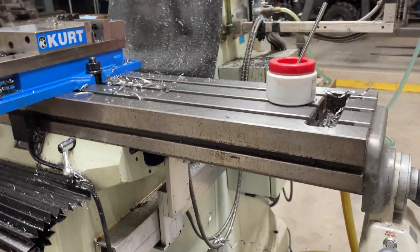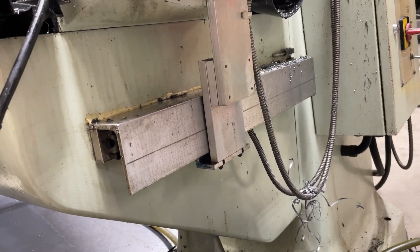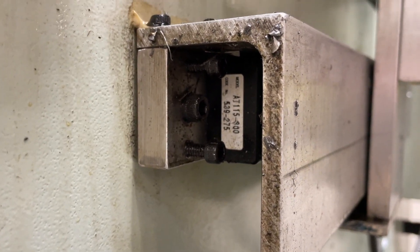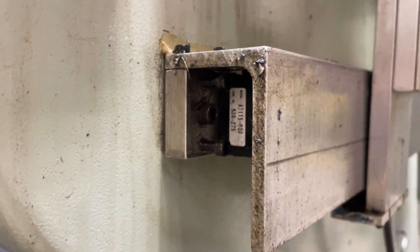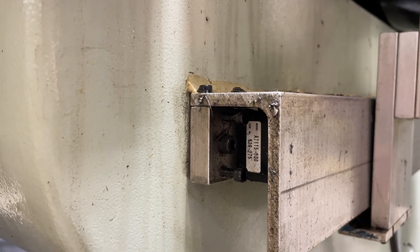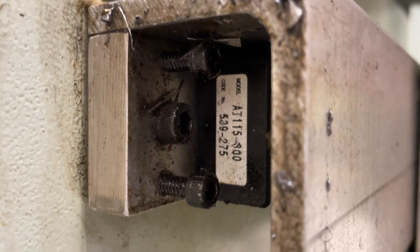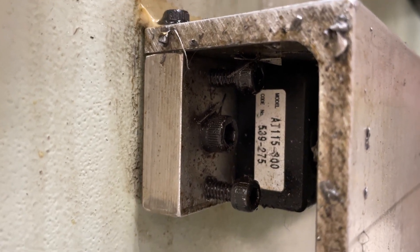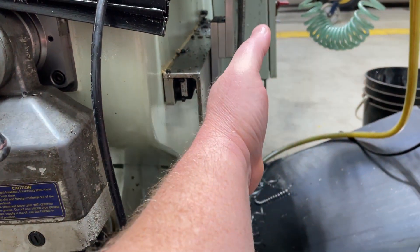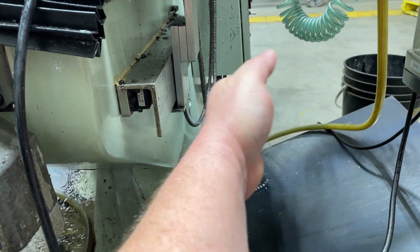The Y-axis was a little bit more complicated. The problem with it is that the knee isn't perfectly parallel on its sides. So I came up with a way — it's nothing special but it worked well — and that's to use a piece of aluminum flat bar. I like using aluminum bar; it's nice and straight and easy to work with, much nicer than steel, and I've used it on all my machines. What I came up with was drilling the ends, putting two jacking screws in and then a bolt at each end. That allows me to get the bar straight up and down and also to correct for left or right.